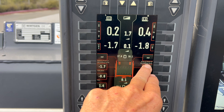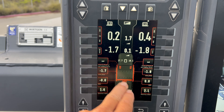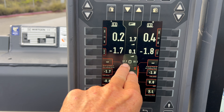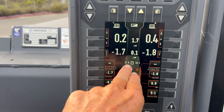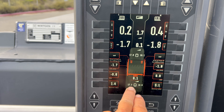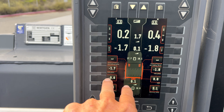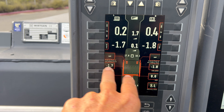Standing in front of the milling drum, that's your rabbit foot — it's out of range right now because it's up. These are your leg heights that show — basically a manual gauge on the legs to tell you how far extended or retracted they are. This is your rear legs, this is your slope, this is your MDI left and right, and your side plate left and right.